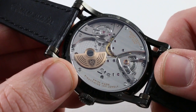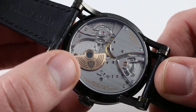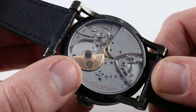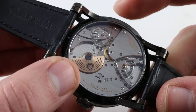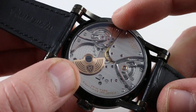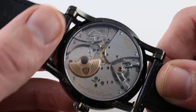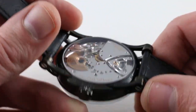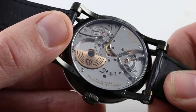What you're looking at is the MCT caliber MCT-52, automatic with a micro rotor, borne on ceramic bearings for high efficiency and low maintenance requirements. It has a big slow balance beating away at 18,000 vibrations per hour. It is free-sprung for the ability to take and hold a precise regulation in the face of bumps and disruptions on the wrist. It's also blessed with an over-coil hairspring, giving it robust resistance to gravitational or positionally induced timing deviation.